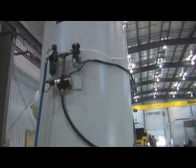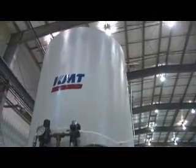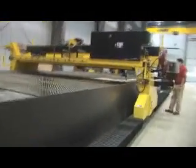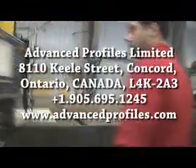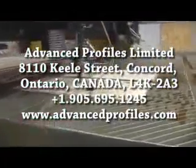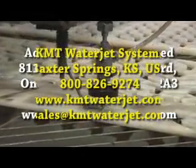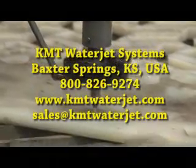In terms of what type of hopper we went with, we decided to go with a full-size hopper from KMT, because it limits the amount of time we have to stop the machine to refill the hopper. We don't have to stop every 4 or 5 hours and start manually dumping bags in. We can just grab the super sack and put it in with a crane. A super sack will last us a fairly long time, so it limits the amount of time that we have to stop and start filling the hopper with little 50-pound bags. We do it all in one shot.